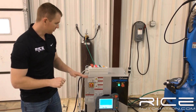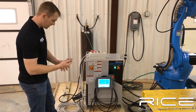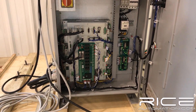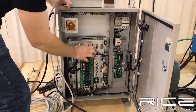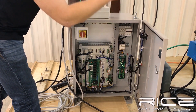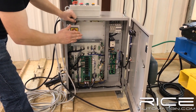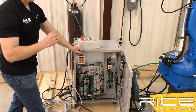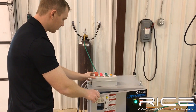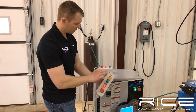Now around to the front of the cabinet — you'll notice the size is small and compact, so you're not working with any kind of big cabinet. Inside we've got our air intake, our main servo board, all of our connections, and an IO board with your outputs and inputs. This is the main contactor — anytime that head trips, it cuts all power to everything. Along with a safety board featuring dual channel safety inputs, so you've got double redundancy on your safety. It also comes standard for two boxes, so you can either start boxes in play mode or put them in remote mode to run two different programs.